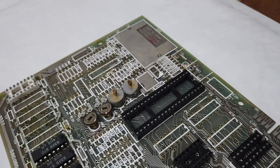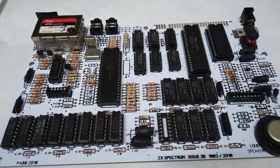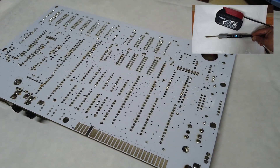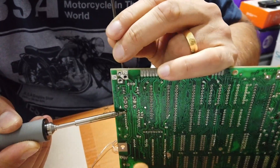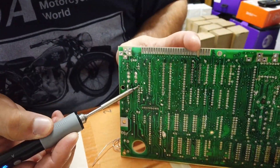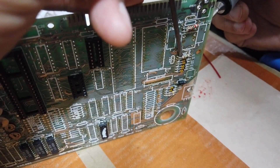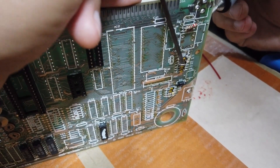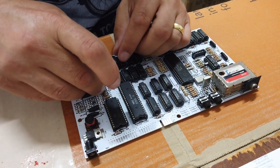The great news is we're there now. Just look at the amount of work that had to happen. Each and every individual component was removed from the old PCB with a soldering iron, and then everything was put on the new PCB. Some of the components were quite difficult to remove. The way I went about removing those was using a soldering iron and a small flat-bladed screwdriver. Occasionally you could remove them as a little row, but sometimes you had to remove each individual component. Yes, I'm cheap. There are some differences between the series two PCB and the series three PCB, and you are going to have to buy some components.